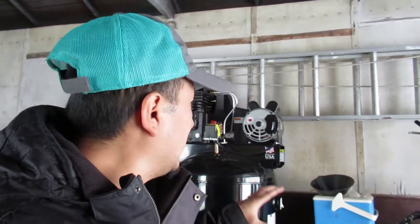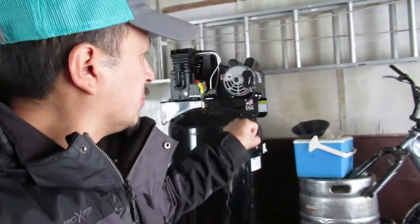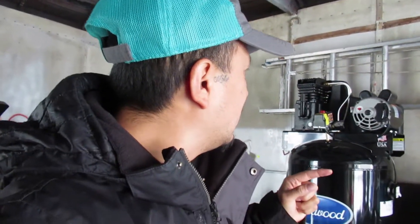You see everybody doing all the copper piping — like a still — and all that. The copper piping drains to keep no dirt or water in the line. Well, between that copper piping on these big ones, you need a rubber jumper hose. The three-quarter inch rubber jumper hoses are expensive, but the reason you need that is because this big motor running shakes the compressor. The rubber hose in between vibrates so it doesn't cause your whole copper line to vibrate.